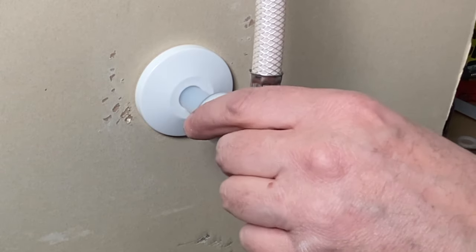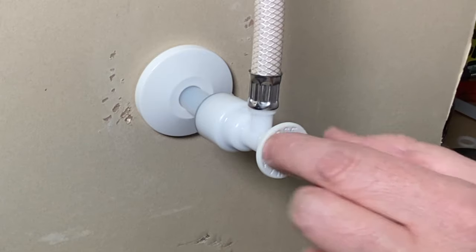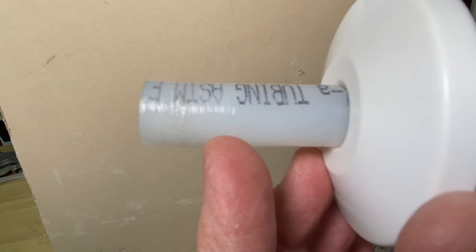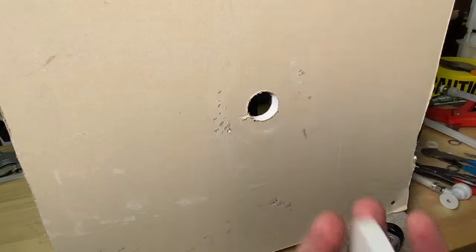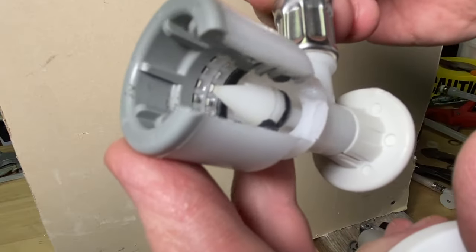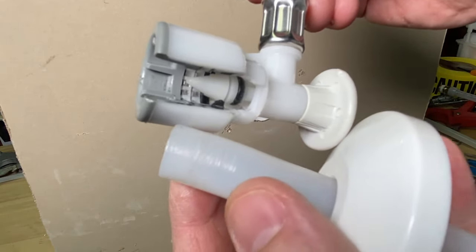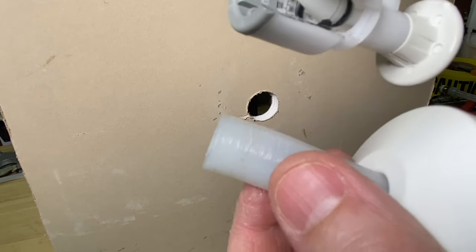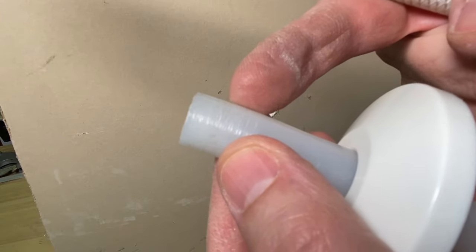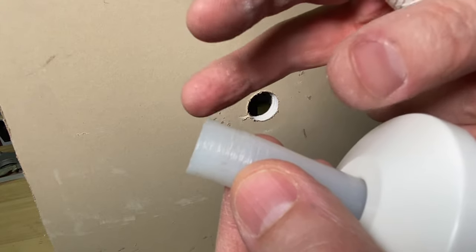You're going to be able to twist these flow tight valves off of Type A PEX, but you don't want to. If you get up close you can see all those cuts right there — that's from twisting this out. Those little teeth are designed to grip. With Type A, this pipe is expandable, so when you go to expand it and stick the expanding tool in, those little slices expand out and get bigger. That's not good.